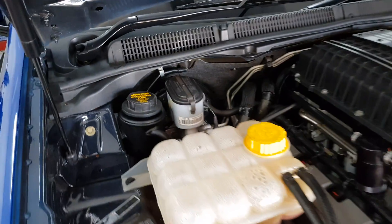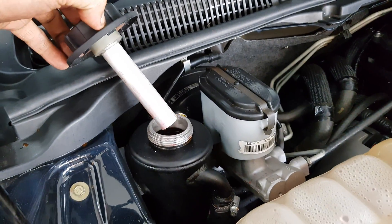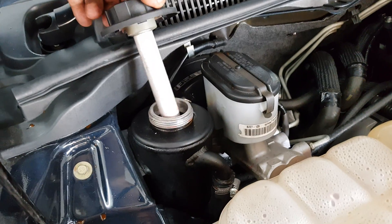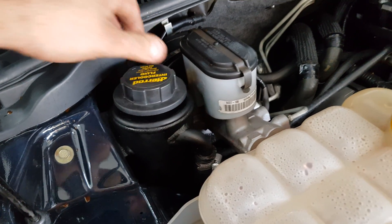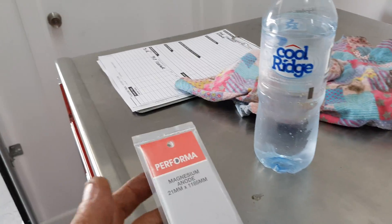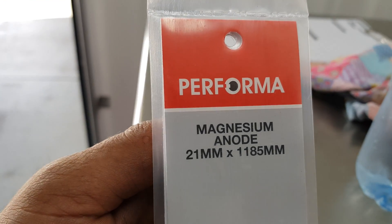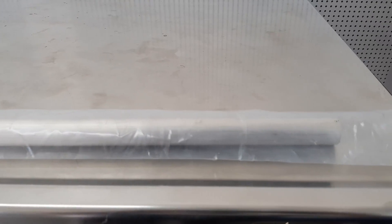Not many people know this, but in this case we've glued an anode to the cap. It's basically a magnesium rod, and that gives the electrolysis somewhere to go. You can purchase it from any plumbing supply or even a boat shop. It comes as a big rod and you just hacksaw off what you need and drop it in the system.